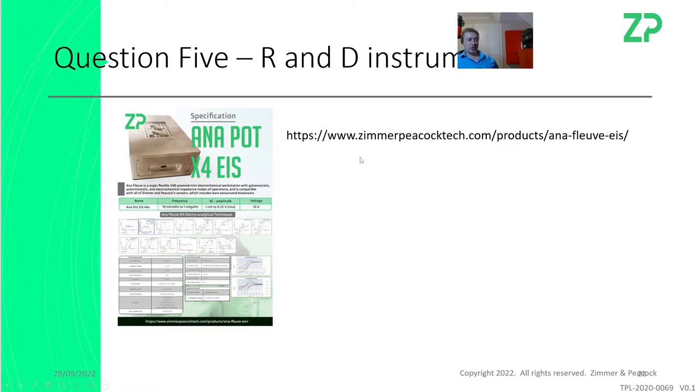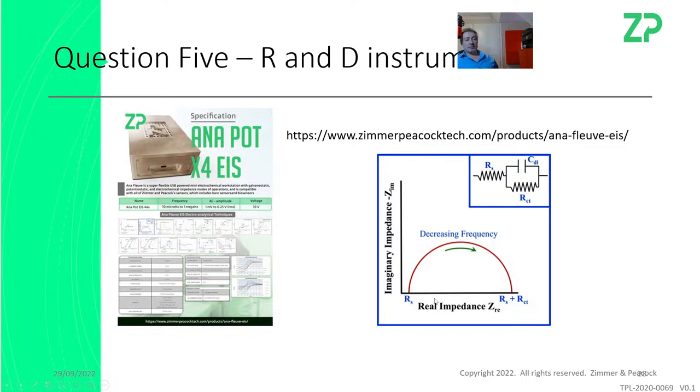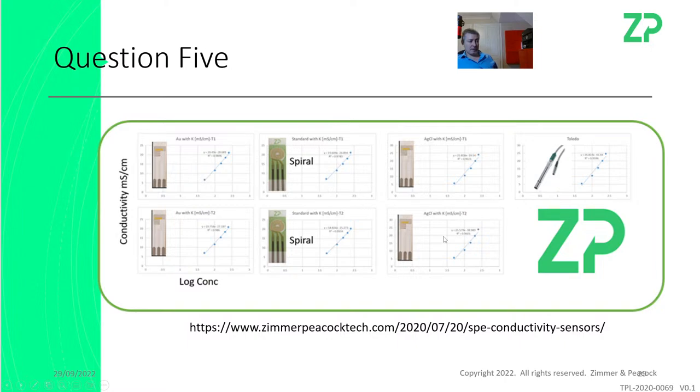So I would have actually done it on an impedance spectrometer, because an impedance spectrometer would allow you to play with both the imaginary impedance and the real impedance. I suspect that the evaluation board is just looking at the real impedance. I'm sure that's fine, but we would have taken a broader spectrum look at it before we went onto the evaluation board. But that's fine. I just want to give that perspective.